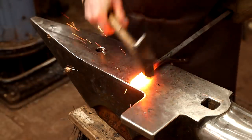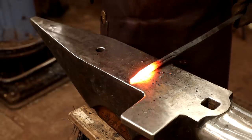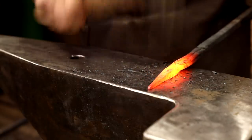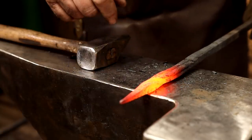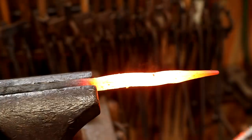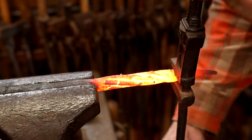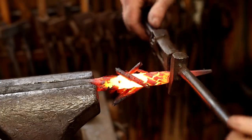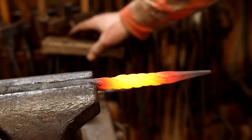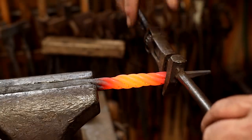You want to do most of this at welding heat. I'm going to go ahead and put a twist in this before I finish that, so I've got a nice section right there that I can grab with a twisting wrench. Try to get as even a heat on this as you can. I'm going to go one full revolution. I'm going to finish drawing this out and hope that I've got just enough space there to get this wrench back on, because the next part of the twist is to untwist it a little.